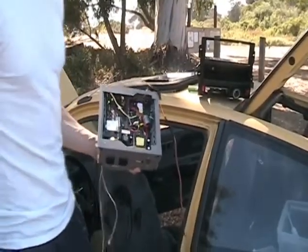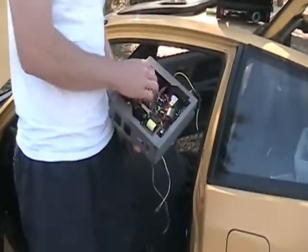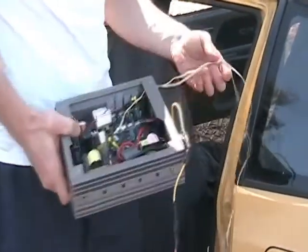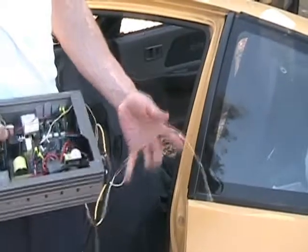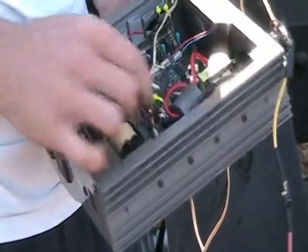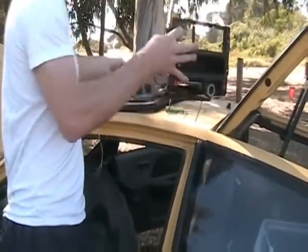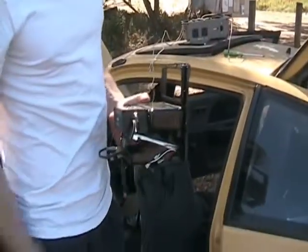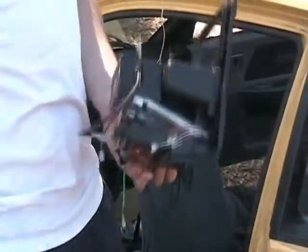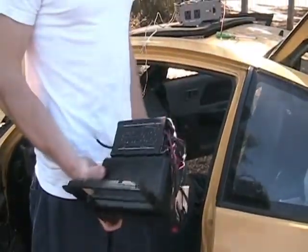Remember the internals of this inverter here. We got the wires hooked up to both of the LED and power switch items, and I didn't mark which was which. To figure that out, we can see red and black here, and red and white here, and we can match those up with the red and black and red and white of the spliced wires — the switch and LED. I'm going to tape these up, and then I'll screw this baby in, and then we'll have one inverter.